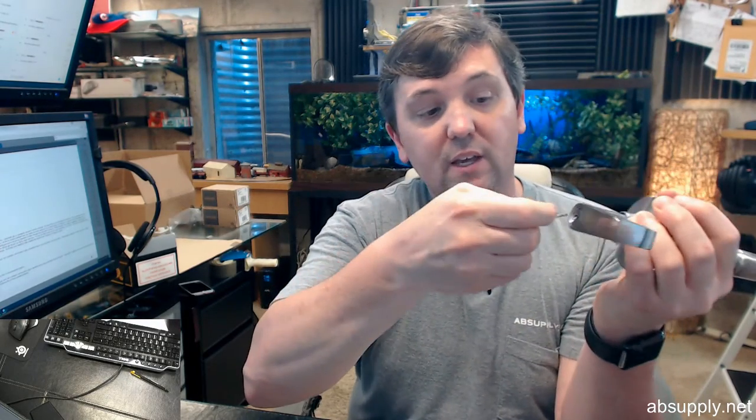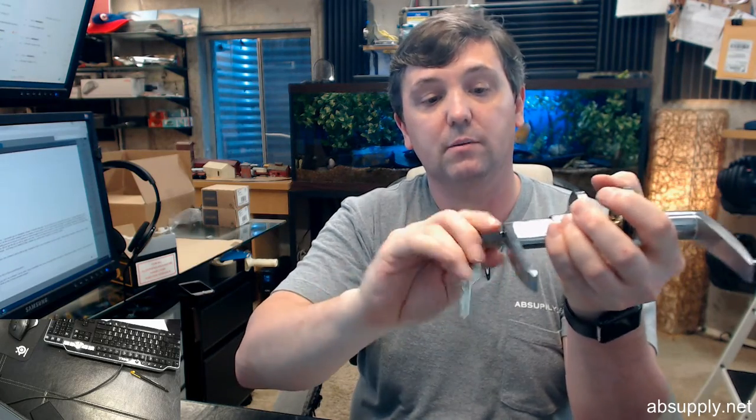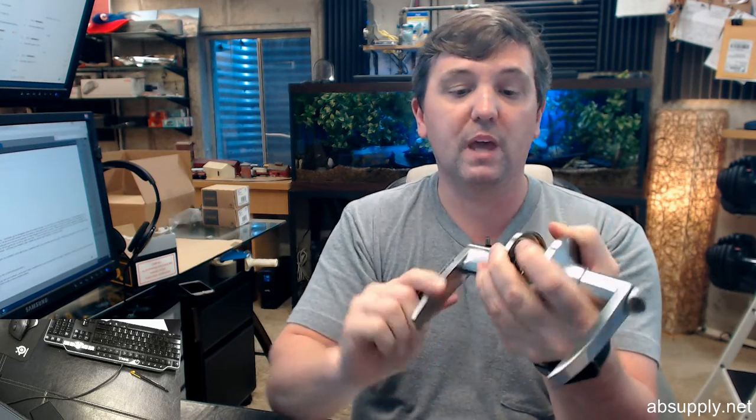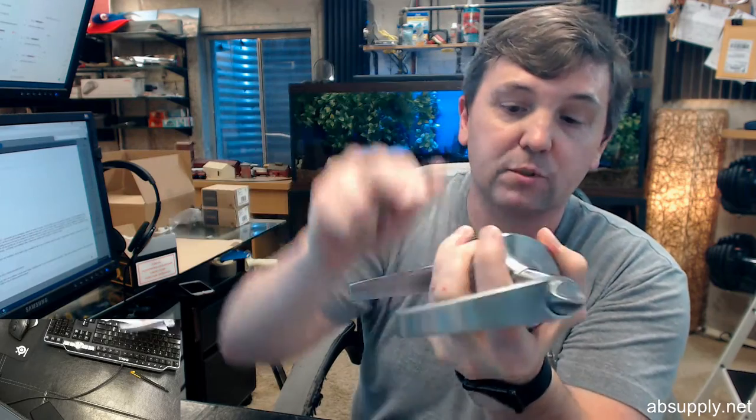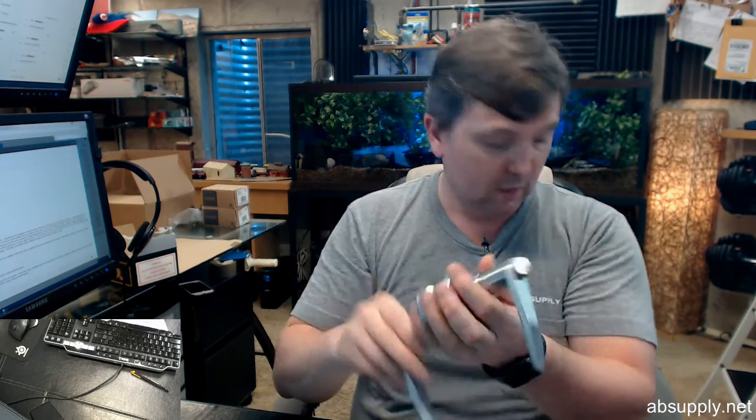You've got a couple of keys that are included with it that you're going to be able to, of course, lock and unlock. You will be able to lock and unlock from the thumb turn on the inside, and this is going to be available in the 10 function. Change 53 to 10 for passage, to 40 for privacy, 53, then 80 for storeroom or vestibule where there's no button on the inside. Okay, let's get some dimensional properties of this lever.